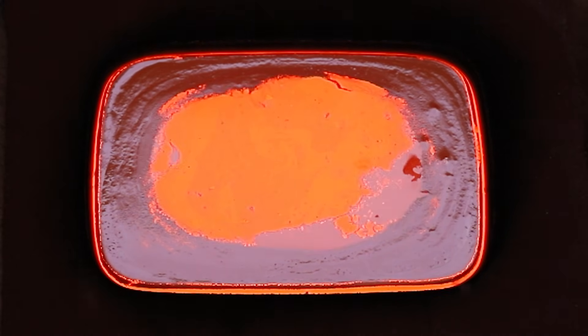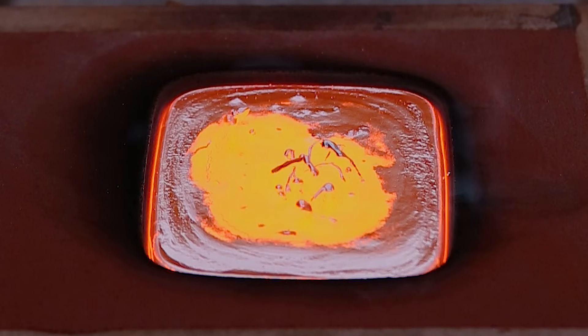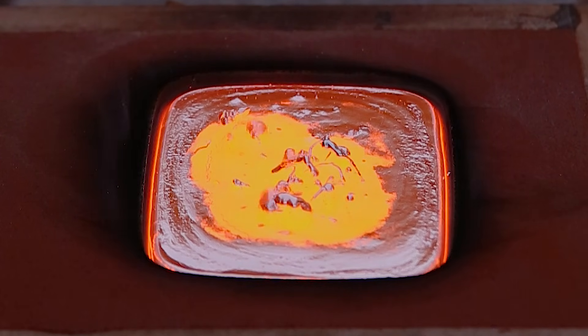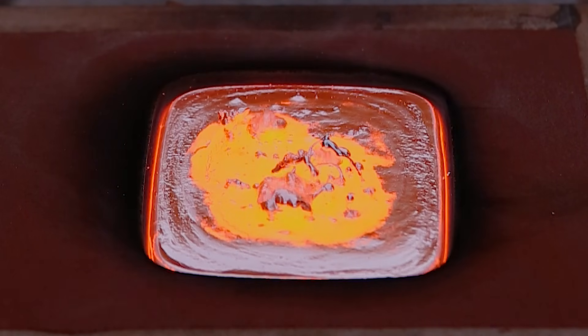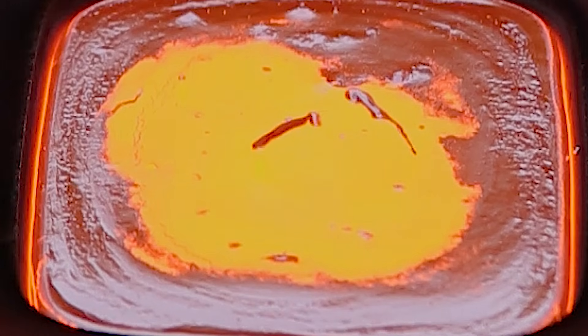I love the way that silver looks as it's slowly solidifying. I'll add the unedited clips at the end of this video for anybody who is as mesmerized as I am. Now this is crazy — right after the top surface appeared to have solidified, little silver sprouts started shooting up. Unfortunately, I was in the middle of moving my camera, otherwise I would have captured better footage. What a strange thing. I did a little research and apparently this is the result of oxygen, which was absorbed during the melt, being released from the center, which pushes out these little silver sprouts and bubbles.